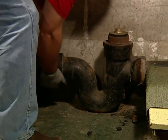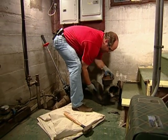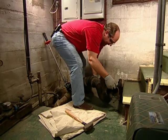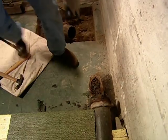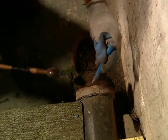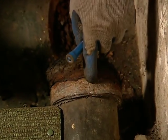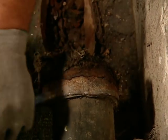Let's try. That can go where it belongs, outside. The last part of the excavation is to get this old lead and oakum off the old pipe. What's oakum? Oakum is a sealing method used for the old lead connection — it's actually oiled hemp. I just want to chisel that away.